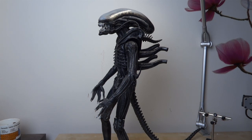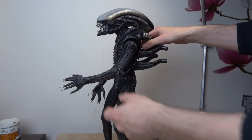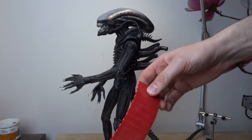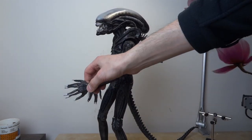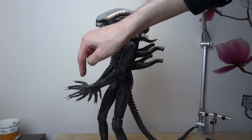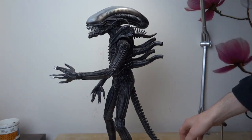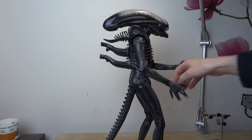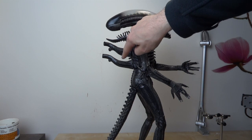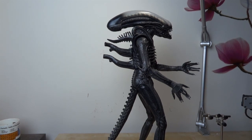So where does that leave us with the alien project? Basically, next time I'm going to start doing the CAD for various parts of a life-size alien suit. It's going to involve pieces that are mainly rubber with rigid reinforcement printed inside them — black rubber and black plastic. We can probably start on the hand: the extra-long fingers can have rigid reinforcement in them, and the detail on the arm can be done in a variety of ways by printing flat or pre-rounded pieces with the rigid reinforcement inside. For other sections we'll need more rigid reinforcement to keep pieces upright, and we can texture those up — we can print pretty much any shape in plastic or rubber. The head is going to be quite interesting, but I'm probably not going to do that first. Subscribe to my channel and check out my Facebook page for future updates.